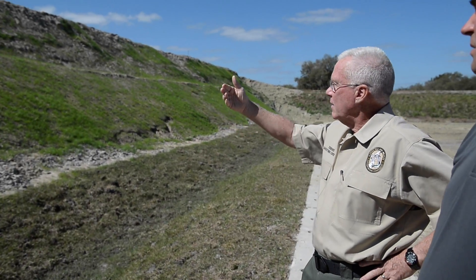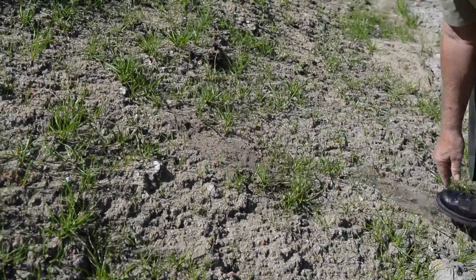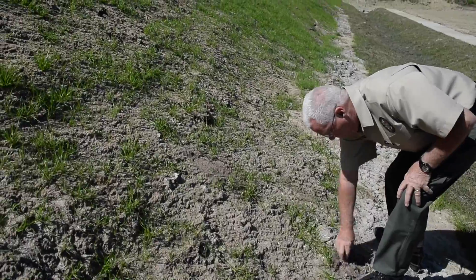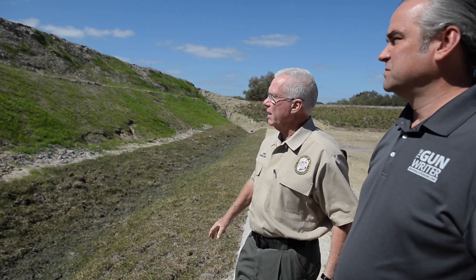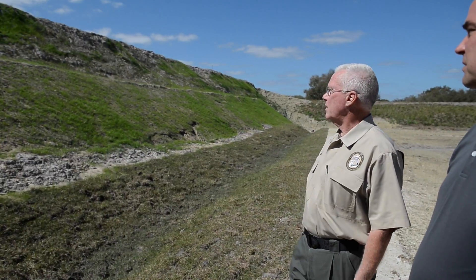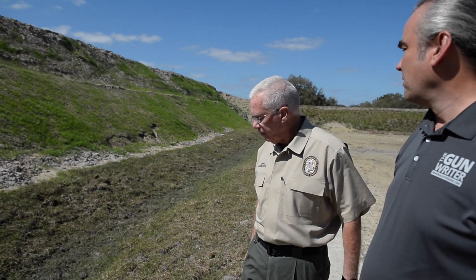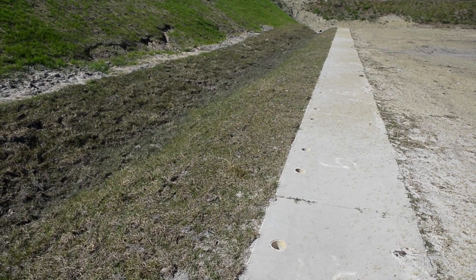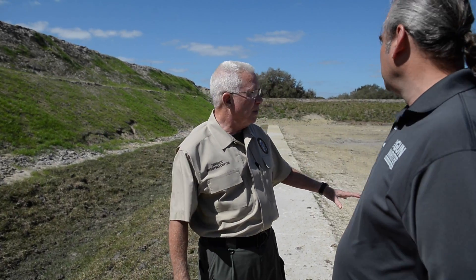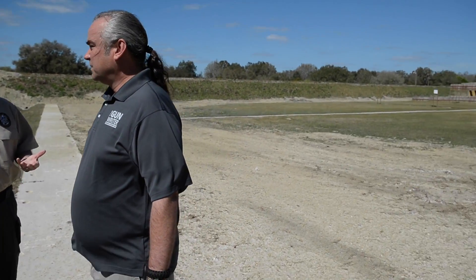This pad that sticks out is called ballistic sand. I don't know the exact composition, but I saw the contractor with four or five different soils and materials in the parking lot mixing them together — almost like concrete — clay, sand, soils, all mixed together and put in place. It sticks out three or four feet. You've got plenty of drainage now. We renewed and created this swale, which did not exist previously. Standing water was a big issue because of all the silting and erosion, and as you know, standing water is dangerous when it comes to shooting.